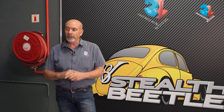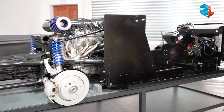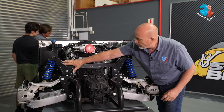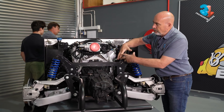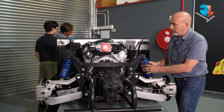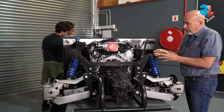We've got a 430 horsepower engine in here with its gearbox. With the engine and gearbox in place you can now refit the crossmember — if you recall, this had to be removed for us to fit the engine. You can put the crossmember back on, put your shock absorbers back on, put these rods back in, and close all this up again.